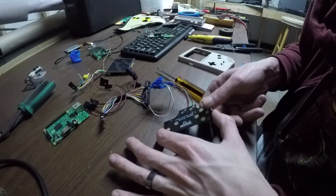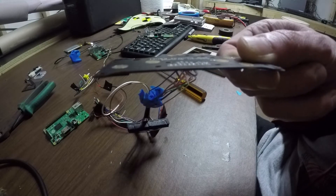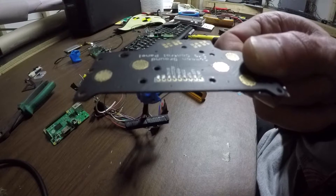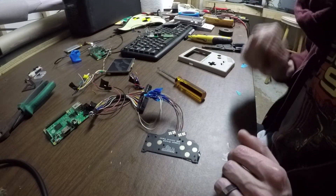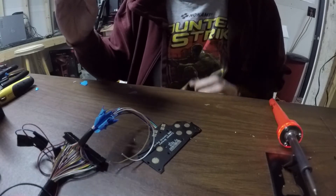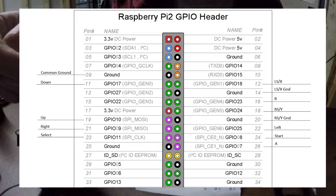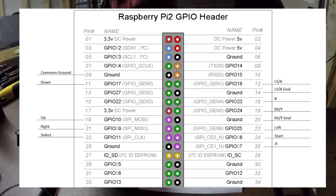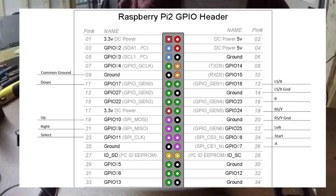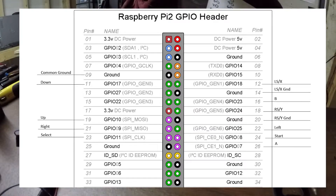When we come back, we will solder that. Well, we had some time after dinner to go ahead and make a go at this. My initial GPIO pinout diagram was incorrect, so I went back and double checked it and remapped it according to the corrected diagram. I went ahead and drew this out — this is our diagram that corresponds to our marked wires. So we're going to go ahead and solder this up.